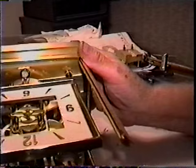But this is what your pallet fork and your roller should look like when you're all finished. Exactly. If you make any deviations, you're going to have problems. And then looking at it from a top view, this is what your fork should look like in between your roller. The distance here and here in between is very, very little, 0.30 millimeters, which is just enough clearance to go through that fork, get its impulse, and then continue on. Those are the nice things that you can see inside the book. That's the nice part I have in a catalog where you can look into it.